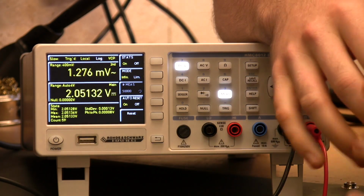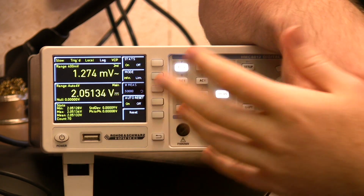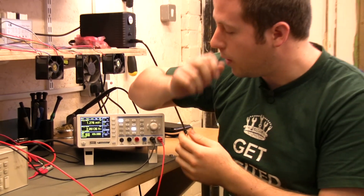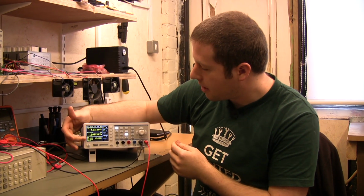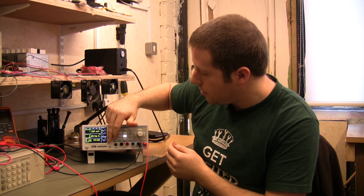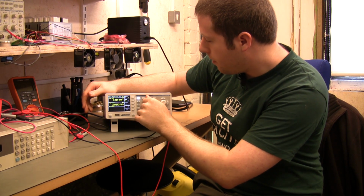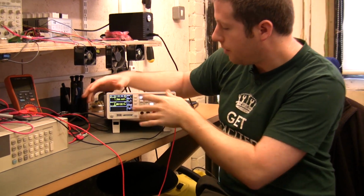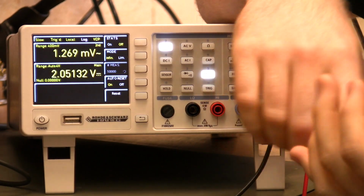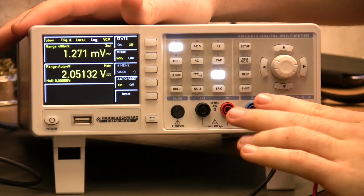You see we're only up to about 60 counts at the moment, but if we want to, we could put this on fast acquisition mode for the ADC and start to build that count a lot quicker. And you see we're starting to get quite a lot more resolution than we had here. If I flip that off for the moment, in this math menu we can also do limits and logging, which I keep on mentioning. We will cover that in a second.